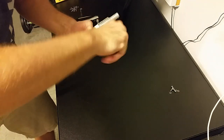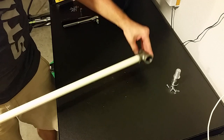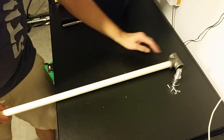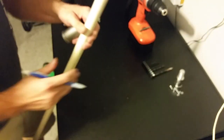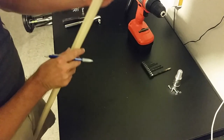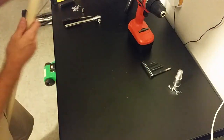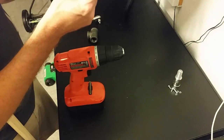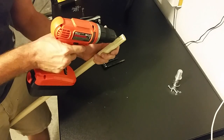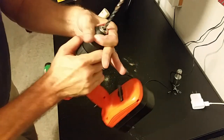Speaking of the handle — take your wood handle, remove that metal piece off the end, and stick that wooden end down into the three-quarter tee. This was a bit tricky, but I'm going to show you the cheapest way to do it, though I've already upgraded mine to a different handle which I think is a much better option — we'll cover that in a minute. I just marked a hole through the tee on the wooden stick, then worked my way up stair-stepping through progressively larger drill bits so I didn't risk cracking the handle.